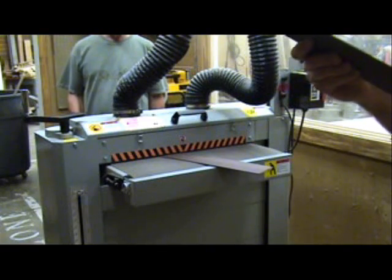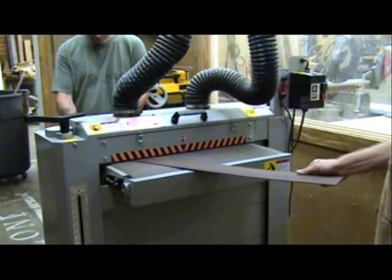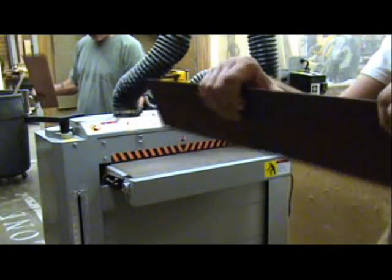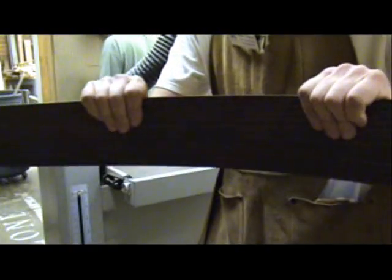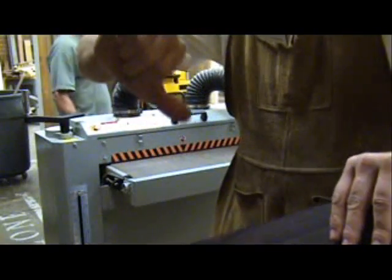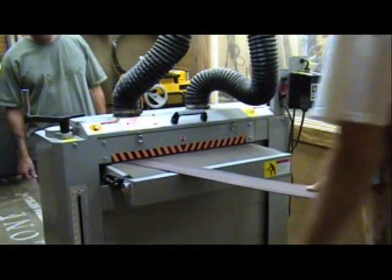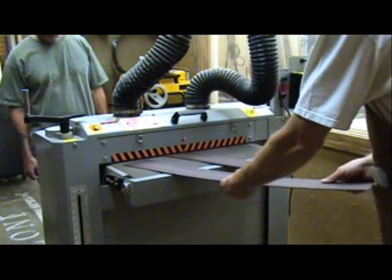Lightly flexing each piece as you send it through the sander will tell you how stiff each side set is. Keep removing the marks left by the safety planer tool by repeatedly sending the sets through the sander. As you sand, you will notice that the sides begin to relax a bit and become more flexible with each pass. As the safety planer marks begin to disappear, I start to keep an eye on the thickness of the sides by checking them with my calipers.